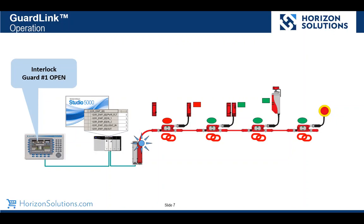Again, in a series wired solution, even though this looks kind of like a series wired solution, we provide additional diagnostic information, which in this case is passed through the safety relay through Ethernet to our controller, which allows our panel view to show that the guard door 1 switch is open. When we do whatever we need to do, clear the jam, or for whatever reason we open the guard door, when our link is satisfied, we're now okay to run.